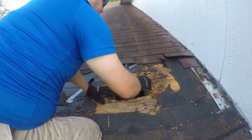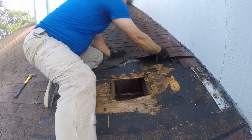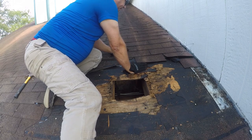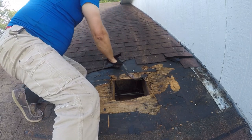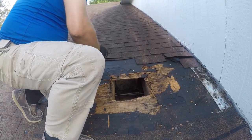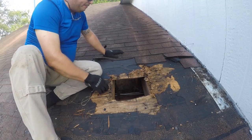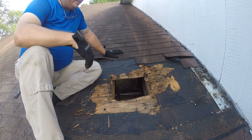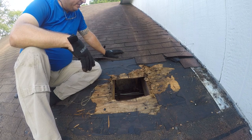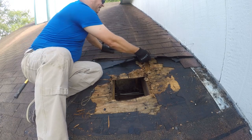I'm not 100% sure what the root cause of this is, but we'll get to it. What I'm looking for is an exposed nail, because that's most likely what caused this problem. What happens is over time water drips down around a nail, gets the wood wet, and rot starts in — that's a normal process. At that point it eventually just rots out if it stays wet long enough.